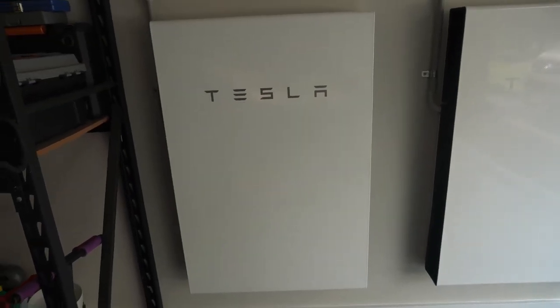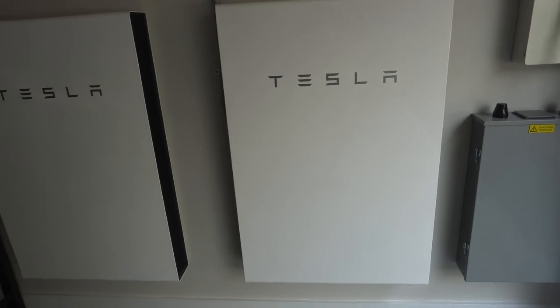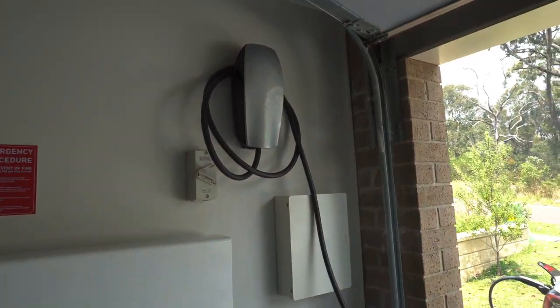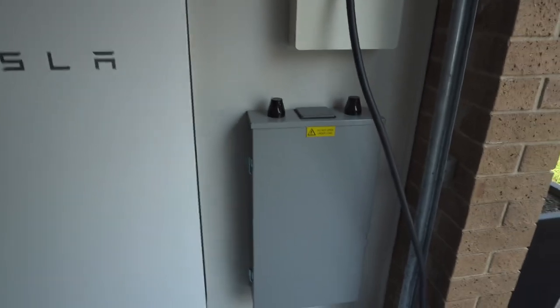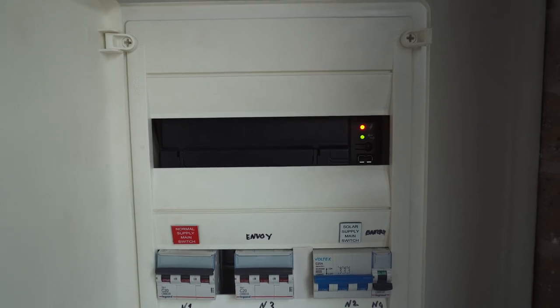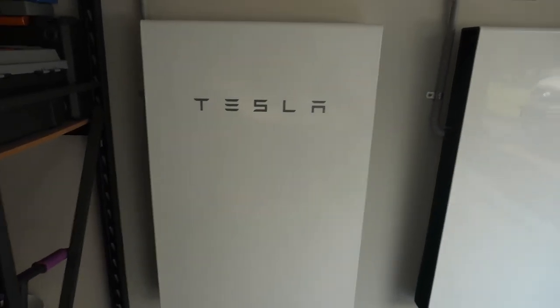Here we are in my garage. I've got my Tesla Powerwall 2's mounted on my eastern wall. Here's the first Tesla Powerwall 2, and just next to it is the second Powerwall 2. More recently installed last week, I've got the high power wall connector, which is connected on a 32 amp breaker, 3 phase. I'll get the full charging rate of about 11 kilowatts on my Tesla Model 3. Just next to that I've got the Tesla Gateway, and in this enclosure here I've got the Enphase Envoy system used to monitor all the data from the micro inverters under each solar panel on the roof. I'll link to a previous video that outlines the entire solar system with some drone shots of the roof.